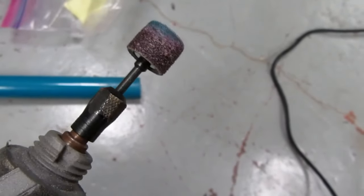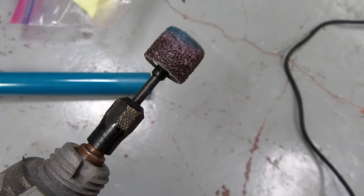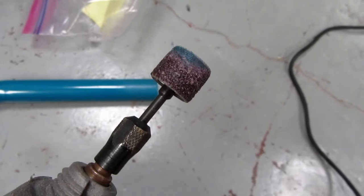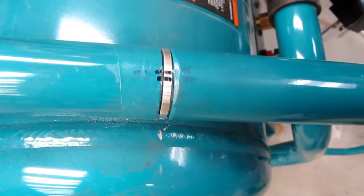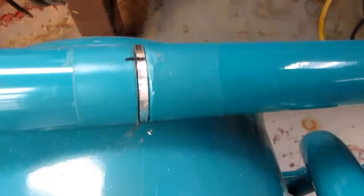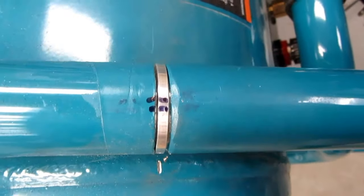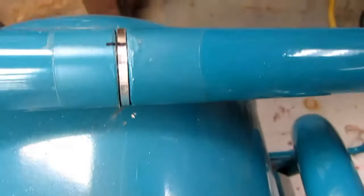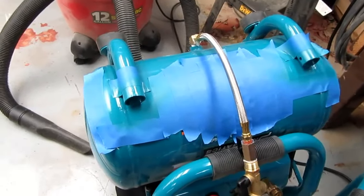Well, the Dremel sanding drum did the trick. It was really just the small weld ridge from where the tubing was rolled and welded that caused the problem. Sanded it out and everything fits nicely. Everything's fitting in there nicely now. I had to go in there with the Dremel cutoff wheel and clean up these surfaces. I'd already done these so that I could get a pretty nice contact point around the shoulder of the plug. Now I just have to drill the holes for the pins. Final touch-up of paint.